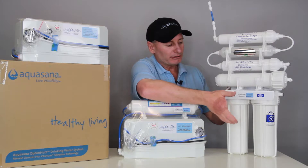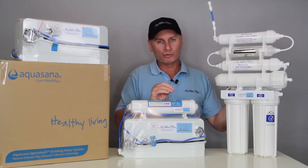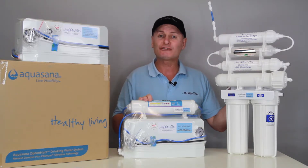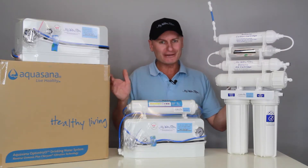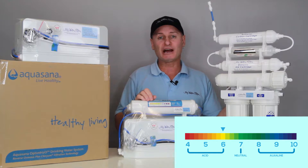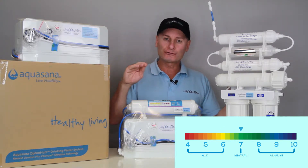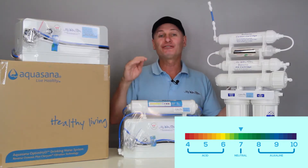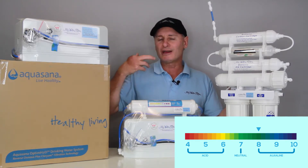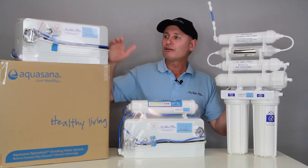Now, what's going to happen — sediment, carbon, membrane — and we've got the water. The water has been stripped of all contaminants, but because these membranes strip the water so fine, they also strip all the minerals out of the water. The water will have a very low TDS reading — there's just about nothing left in it. And what happens then is the pH of the water is going to plummet. You're probably going to have water at about 6 pH. You don't want to be drinking 6 pH water. 7 pH is neutral on the scale, and we'd love to have water just a little bit above 7. We really want people consuming water above 7 pH, so it's not stripping minerals out of their body and not slowly creating acidity inside your body.